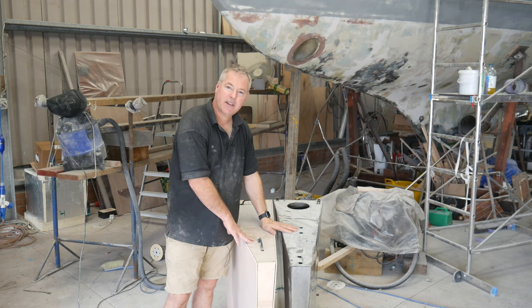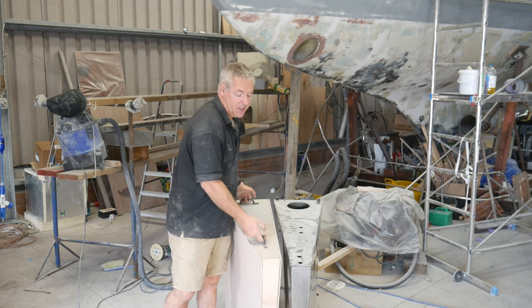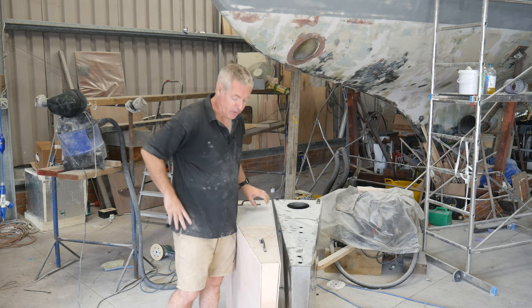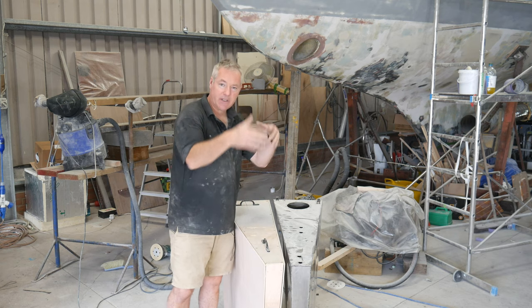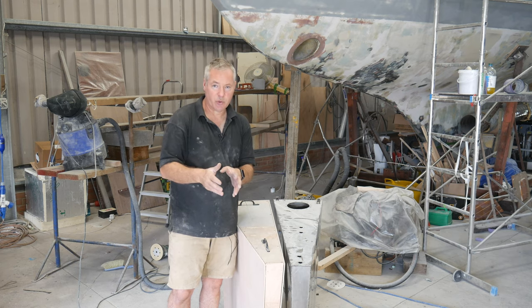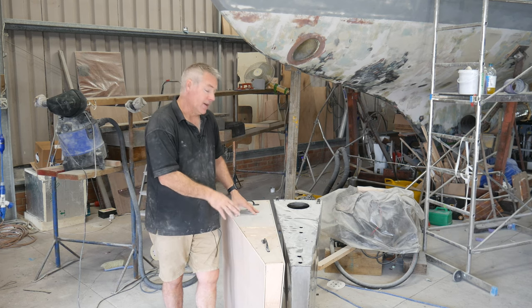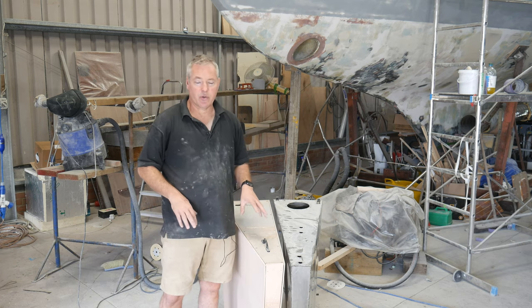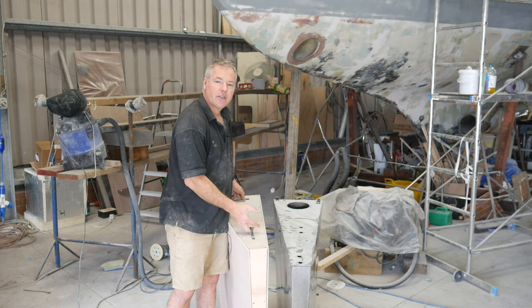Here's the test - two tanks, and I did such a great job I bet you can't even tell them apart. I'd say it's probably good to about a millimetre difference. I'm really pleased with it. Now I can take this into the boat and see if it'll fit down through the hatch, how it's going to move into the bilge, and how it's going to sit down in there. Then I can think about how I might rejig this a little bit so I can actually fasten it into the bilge - because the last thing I want is to laminate the whole thing back in, as that's just too much of a pain to get to in future.